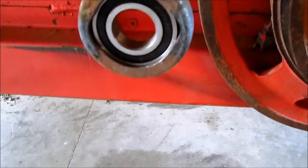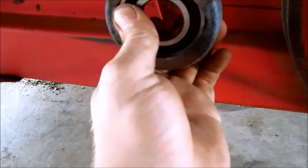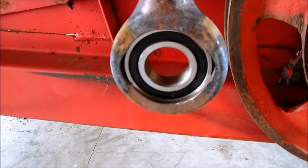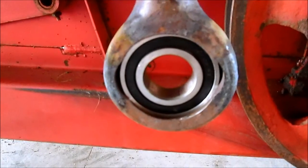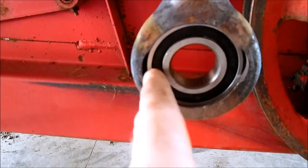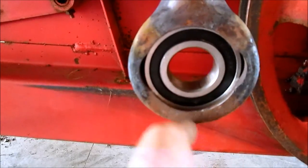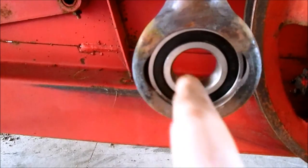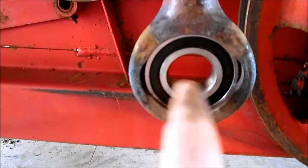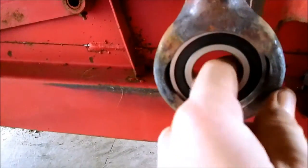It's been a day since I heat-shrinked this and it's still a hair loose — a little too loose for my liking. I'm going to try and heat-shrink it one more time. And if that doesn't work, I will install the bearing turned sideways within probably half an inch of this slot here, and weld just a small tack weld — you don't want a lot of heat to this outer bearing race. Then once I turn that right back in, that locks it in. You can actually buy bearings with an anti-rotation tit on them, but this being an Agco part, that's just what they sent me.